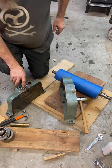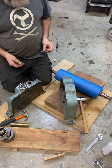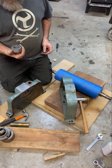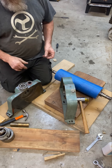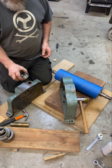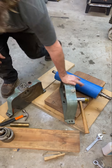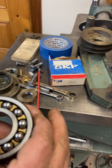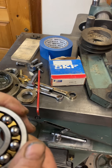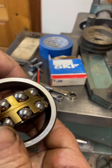Well, I went this far, might as well change the bearings. Someone's been into this machine before and changed the bearings, and of course they picked cheaper bearings. It's hard to say — I haven't got a name on these, they do say England though, so they're not Chinese bearings. They are a double row self-aligning bearing. Here is the bearing I'm going to put in — this is a SKF 2306 M.